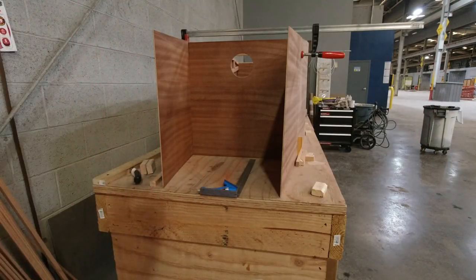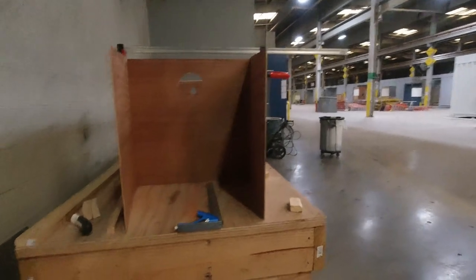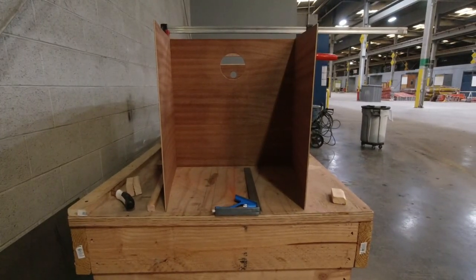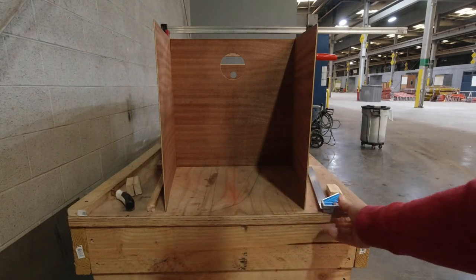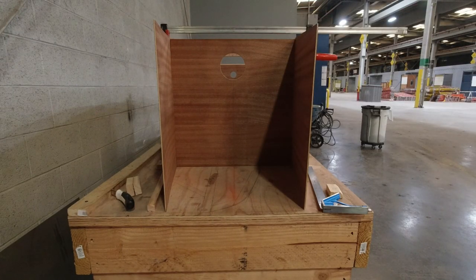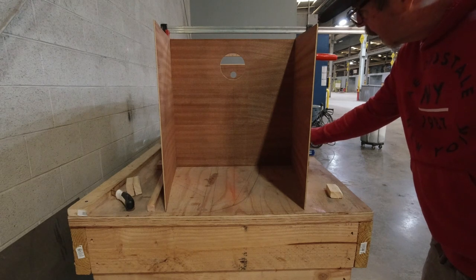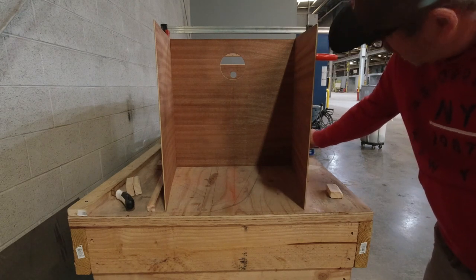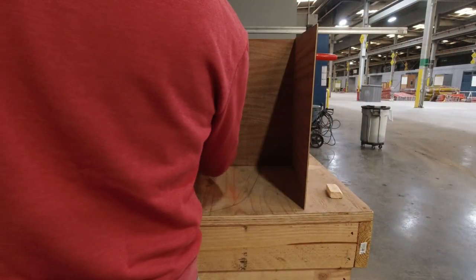To say that actually that looks really good right now. Let me move you over here so you can actually see the center. I'm tracking right on my center line. Right on my center line right here. The only thing I notice is that I've got good contact left and right toward the middle. I need to actually get a little more push at the very bottom and a little more push at the very top. And I'll just quickly check how this is going here. And it's actually looking really square this way.